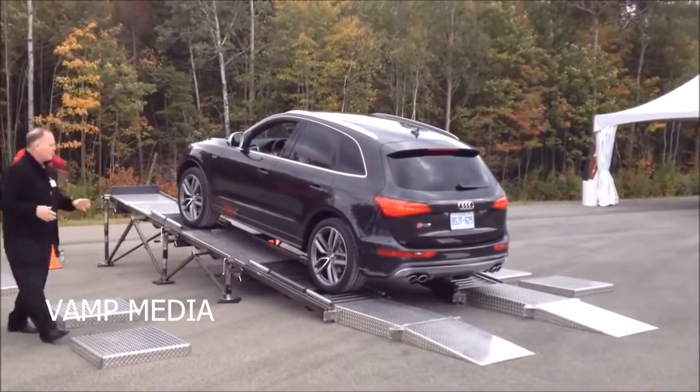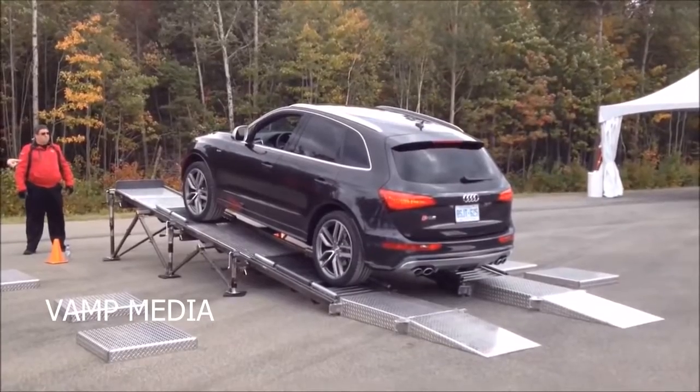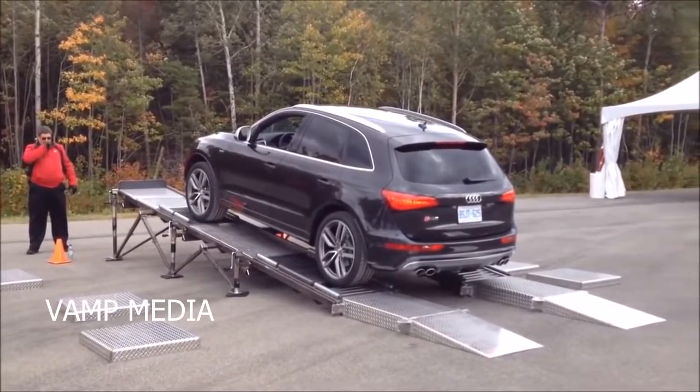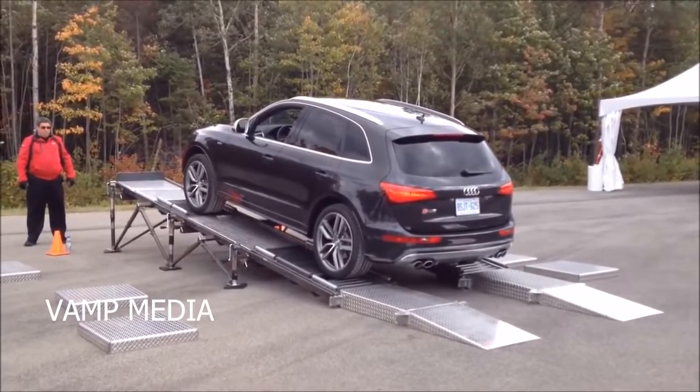Okay. So now in theory, the rears are really going to spin just like before, but now we've got a liability here where the diff in front, it's an open differential. There are no clutch packs there, so it's going to be EDL on either side that determines where the torque goes. Go ahead.